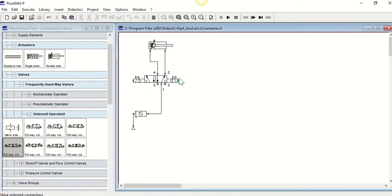Now there's a couple of things on this diagram. We just have a 5-2 valve, and then we have two solenoids that are operating here on the side, which you can see with a slanted line. We have a manual override push button on the top. We're told this is an impulse valve, so there's no internal spring back. If you activate one side, the valve will stay in place. It's a detent valve, as I would say. It stays in its last known position. So that's something to always check.